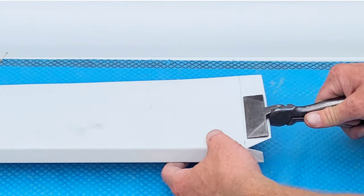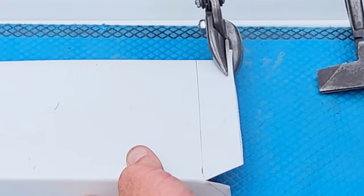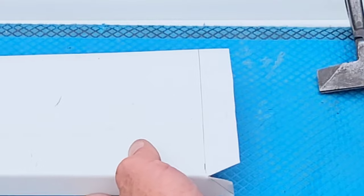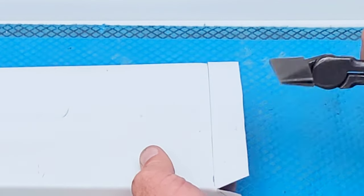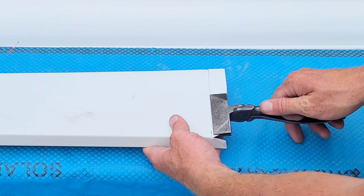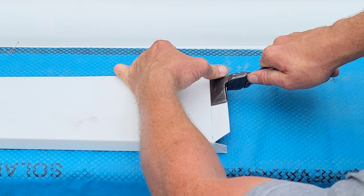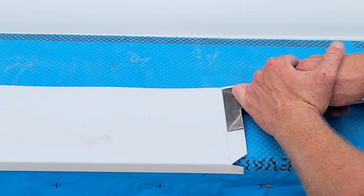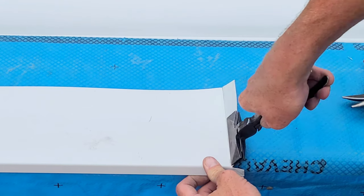Once I've notched that properly, it looks like I've left too much allowance for my one-inch deep folders. I'm just going to shorten it down by cutting more off — no big deal, or get some deeper folders, but this will do just fine. I'll put a little starting notch — this helps with that kink. Now I put it flat on the bench, push my folders into the bench, and bend at the same time, and it gives a really nice crease in that metal.